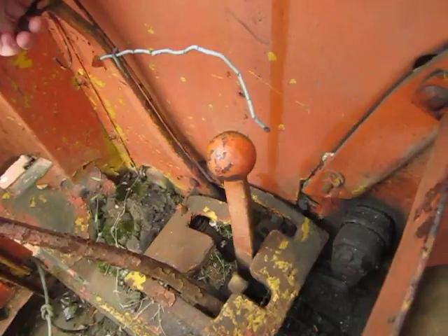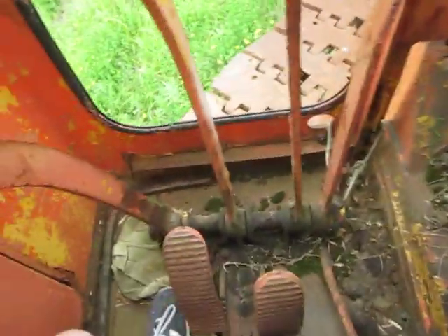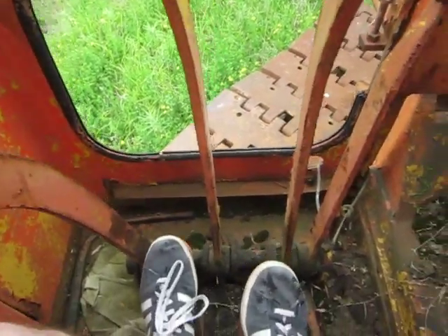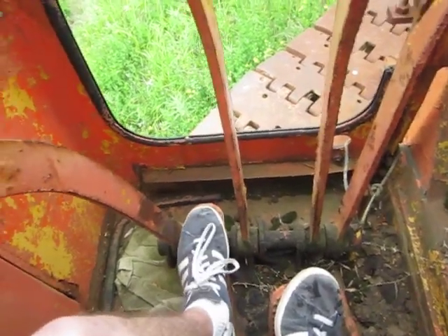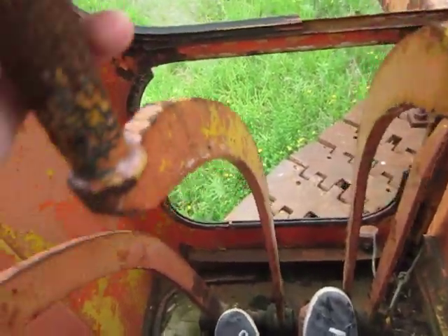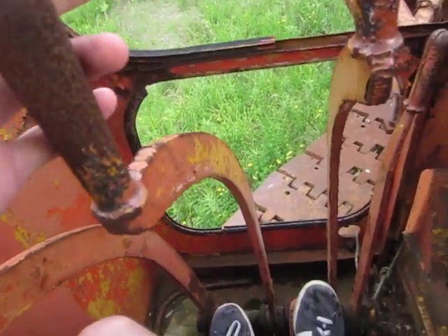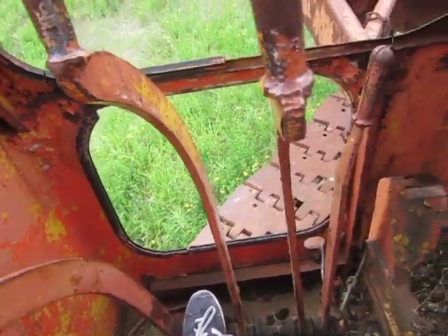This is your tracks — travel one direction, travel the other direction, and center is just traveling straight. Here's your two foot pedals. These control your drag and hoist, which stops it and prevents the cable from freewheeling out after you pull it in. You'd pull on the clutch which engages over here, and once you've got it back to the proper place where you want it, step on your pedal and release the clutch. You're good to go.